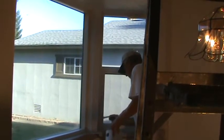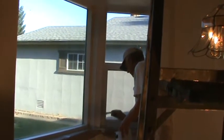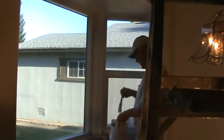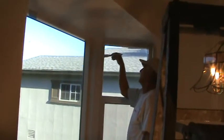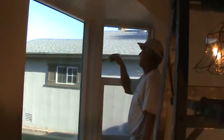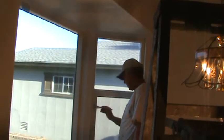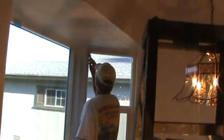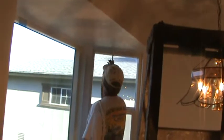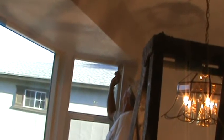You're doing it right up against the window because you put masking tape down there first and that's good to go. Are you going to paint it just like that on the finish too or try to cut it in? I'll probably paint it like this on the finish and then take the tape off. I might have to run a bead of caulking just to finish it off — a nice smooth, tight line. You'll caulk it last. Strip the tape off, caulk it after the finished paint goes on, and you're ready to go with a finished bead of caulk. Having a nice tight finished edge is the key — get it too big and you've messed up your paint job.